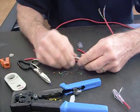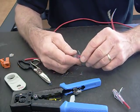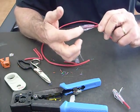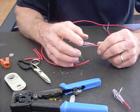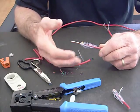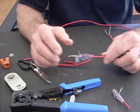Once I've done this, I'll take the strain relief and slide it in the back. I like to put the tab underneath the locking latch — you can put it over, but I like it underneath because it keeps pressure on the locking latch. It really prevents the connector from having the tendency, after it's been plugged in, of becoming disconnected and having intermittence on your connection.